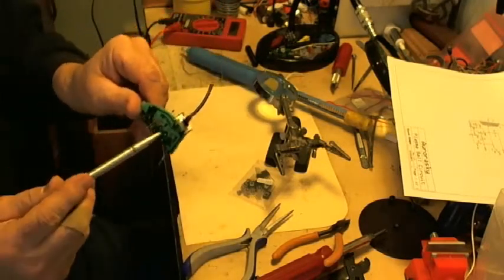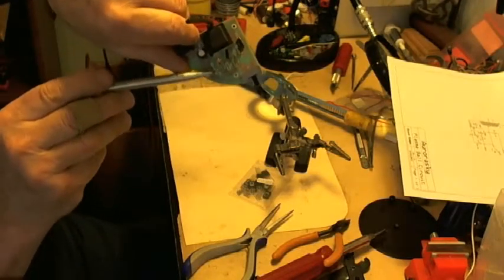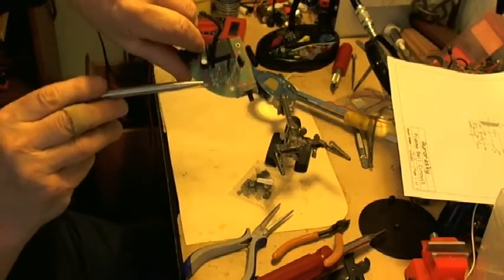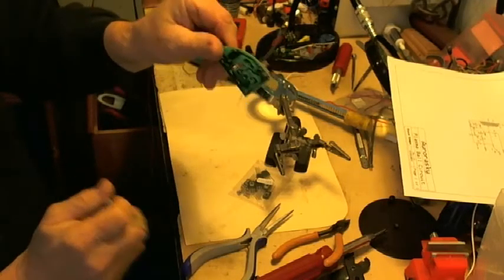Also connected to the base lead of the second transistor is a resistor. And here's that resistor. I've plugged it in already. Nothing's been soldered yet. Again, hopefully you can blow the video up and see these details. But I've followed this schematic, schematic number 2, identically. And I've used the existing land patterns on the circuit board to have a place to solder components to, drilling a few extra holes and so forth.